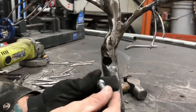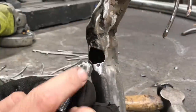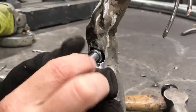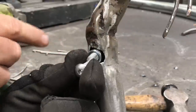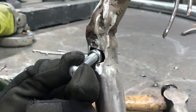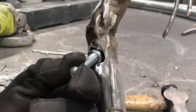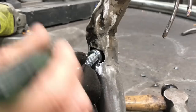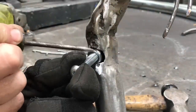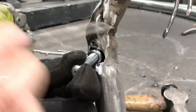I can get a nice little taper so it'll go in just like so, or I can weld that in place and then undo the bolt and fill it in there. Since I'm using this whole nut, I'm not going to push it flush back in there. I'm actually going to leave it about an eighth inch sticking out so I can start my weld on that nut, hit the metal, and then be able to push the weld pool onto this very thin, already quite fragile metal. Then once I tack all that up, I can unscrew the bolt and weld it in. And if I don't like the look of it sticking out, I have enough material on this nut to sand down and give a little smoother contour to the tree base.